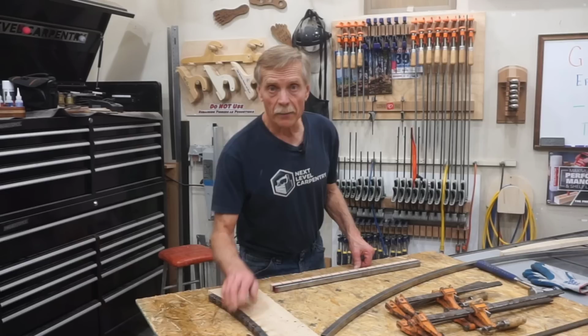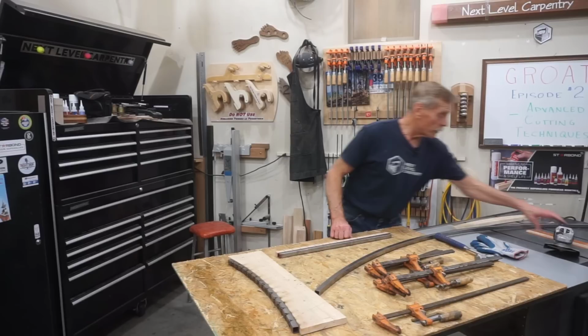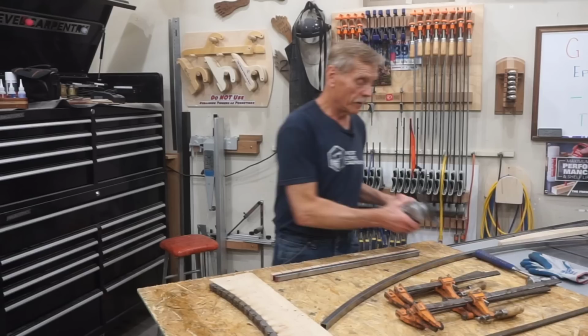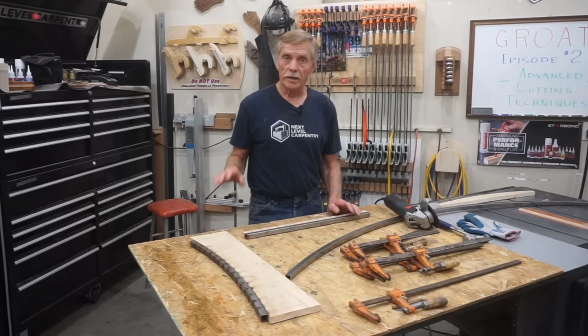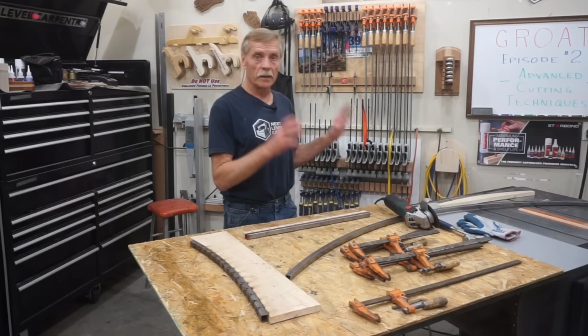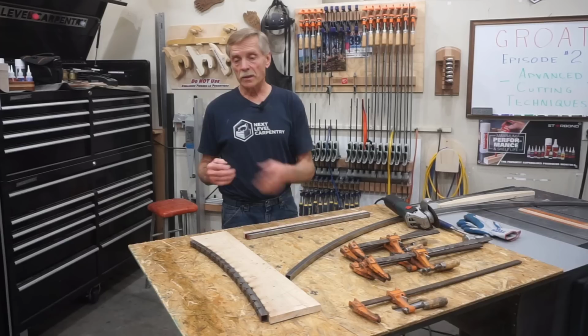So I've got to backtrack a little bit and do this again, and I'm going to approach it cutting those kerfs, not with the Evolution chop saw, but with a 40-thousandths thick cutoff wheel, because a 1/8 inch kerf is just too wide for the job, makes the rest of this too difficult. An experienced welder, I'm sure, could bridge those gaps and learn how to manage the heat. But basically, that wide of a kerf isn't necessary. And I'm just going to leave this whole segment in the video, because the steps that I went through to get to this stage with this tube are valid.